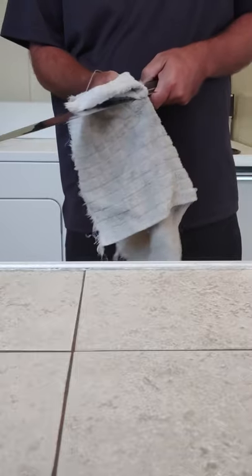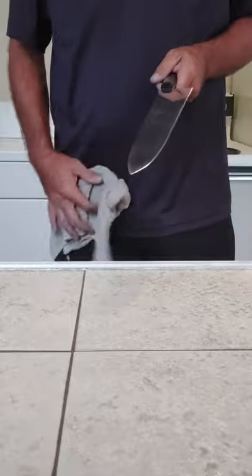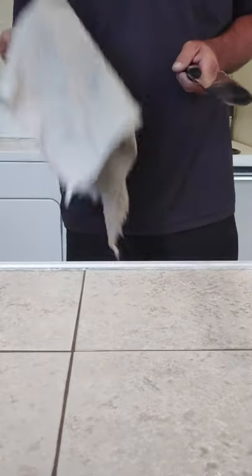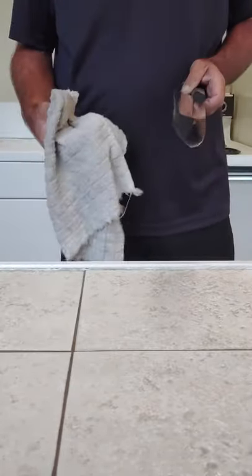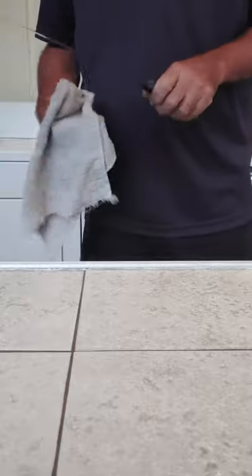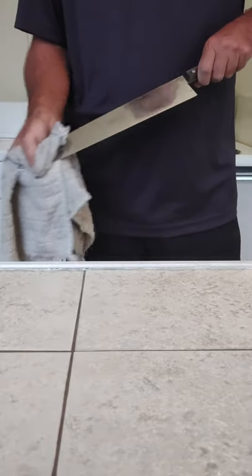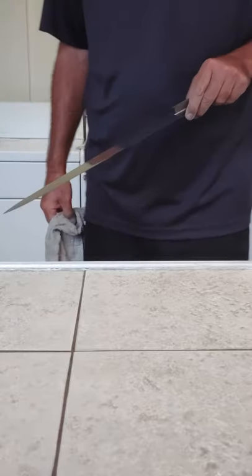I have a little bit of scuffing to polish and some other odds and ends here. It's very hard, especially with a thick knife, to grind on it for close to 2 hours without getting an errant scuff here or there, especially when you're working with spending most of that time on very coarse whetstones. Even if you don't make a mistake in your motions, little blobs of slurry will build up and you run your knife through them and they'll mark up the side of the blade a little bit.